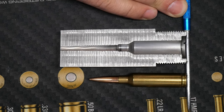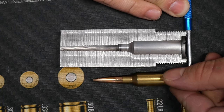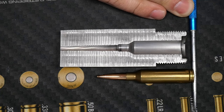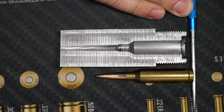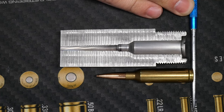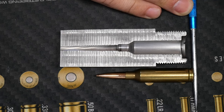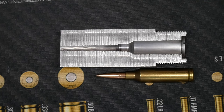On the opposite side of that, if your headspace is too short, that essentially pulls your cartridge back and it can't go as far into the barrel. Because your cartridge gets stopped before it's supposed to, the bolt can't come all the way forward to the point where it can close. So headspace is a very tightly controlled part of the chamber — one of the most critical features — and essentially determines how that gun is going to function and if it's safe to shoot.